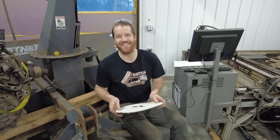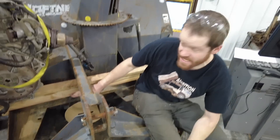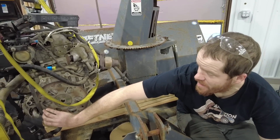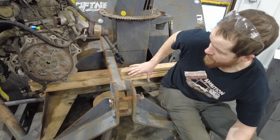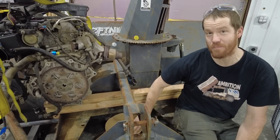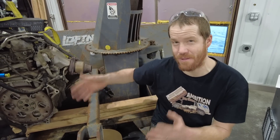I'm already busting out the CAD. This represents a drive pulley on the PTO input for the blower. The plan is a 12 inch diameter pulley on the blower and a three and a half inch diameter pulley coming out of the crank of the engine, with a series of three v-belts connecting them. When the engine drives at 2500 RPM, that should be 750 RPM on the PTO — right in the sweet spot for a 540 or 1000 PTO blower.